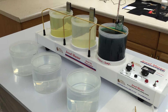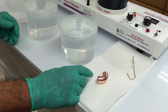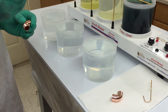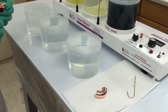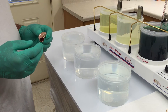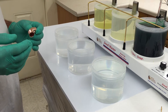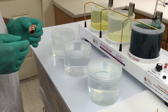We're going to demonstrate nickel plating onto some copper pieces. The one thing you need to remember about nickel is that it takes about five times the amount of power per area for the area that you're plating. So you're going to be somewhat limited to how big of pieces you can plate with the Jewel Master. If you want to do a lot of pieces, or production plating with very large pieces, it would be better to set up a larger plating bath — maybe a one gallon or even up to a five gallon nickel bath.